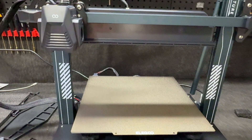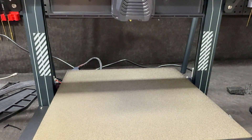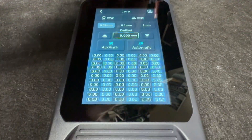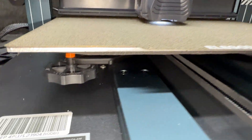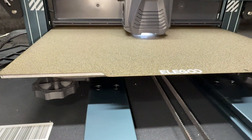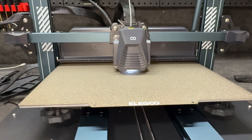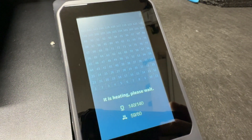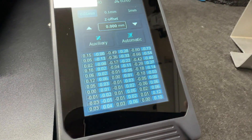I'll let it do its thing — and I almost forgot to push automatic calibrate. One thing this printer has that my others don't is adjustment knobs on the bed. The other printers are rigidly mounted, so if your print comes out with a lean you can actually adjust the bed and recalibrate to straighten it. For reference, this printer has 121 leveling points — more than any other printer I've had. It goes through all 121 points across the entire bed, and then the leveling is complete.